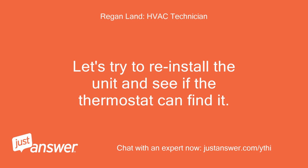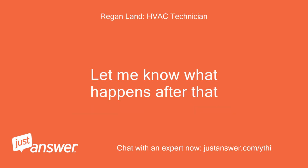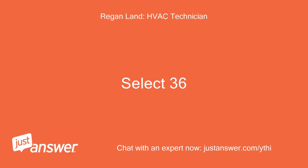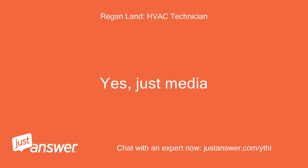Let's try to reinstall the unit and see if the thermostat can find it. Press the back button, then scroll down and highlight Install and press Select. Press Install. Let me know what happens after that. I selected AC. Now it's asking for 30 to 48 kBTU. Select 36. Select Media. Yes, just media.